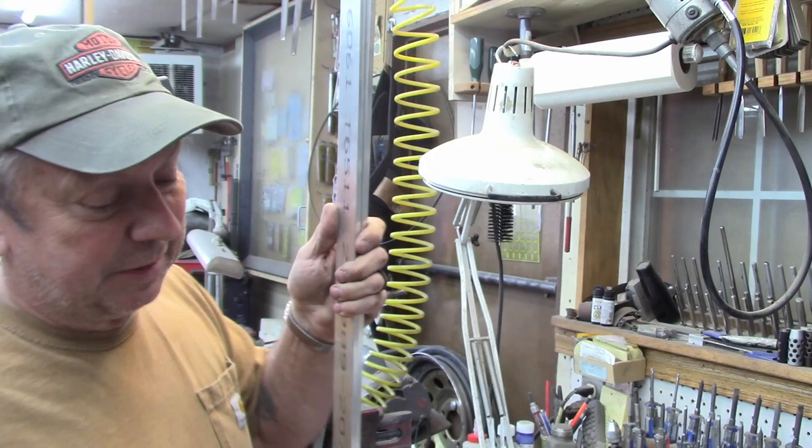So the dimensions for those jaws are 2.5 inches long, 3/8 inches thick, and 7/8 of an inch tall. And they're aluminum, is what these reproductions are. And that's fine. That's a useful accessory for your machine. But let's go along with the theme of making our Atlas machines affordable to have. So, replacement stock out of 6061 T6 aluminum.